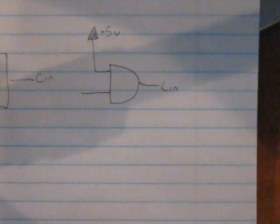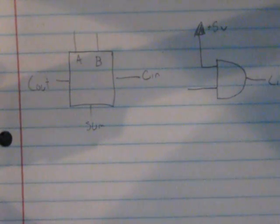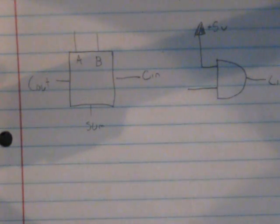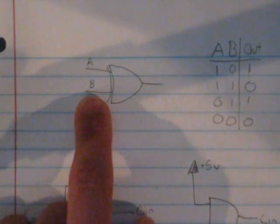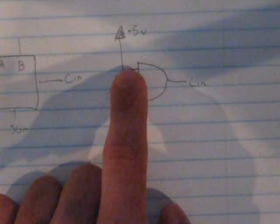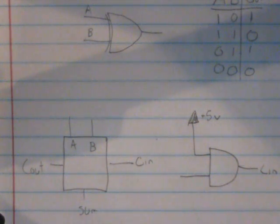In the next tutorial, we are actually going to be constructing this portion of the circuit. We're going to be hooking up 8 different exclusive OR gates — one for each bit of the input — so 8 of them will be hooked up to the B input. The A inputs of each exclusive OR gate will be hooked up to the control matrix, and the B inputs will be hooked up to the switch for the B input — for now it's a switch, but later it'll be the registers. The AND gate output goes to the carry-in, one input goes to power, and one input goes to the control matrix. These will allow us to invert the bits and add one so we can perform subtraction with our ALU.